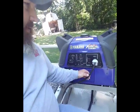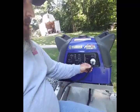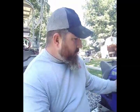This wire itself is a 10-3 trunk, okay? This is intended for outdoor landscaping, and I bought it at Lowe's, okay? It comes in like a 50-foot roll, and wasn't terrible price-wise. So 10-3, what's that mean? That means you've got 3 wires in there, and they're all 10 gauge, okay? So you need a positive and a neutral and a ground, all right?